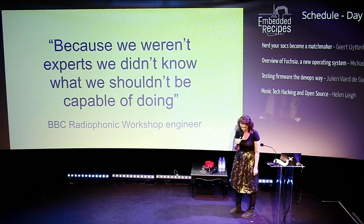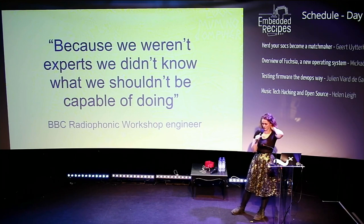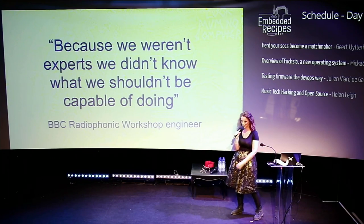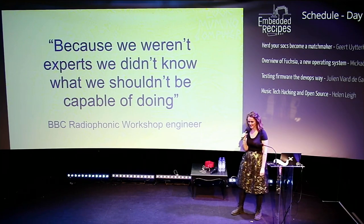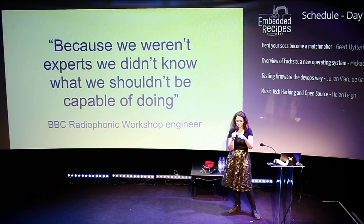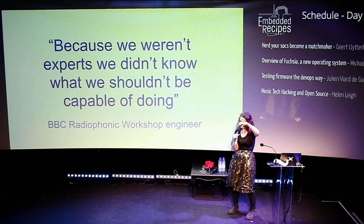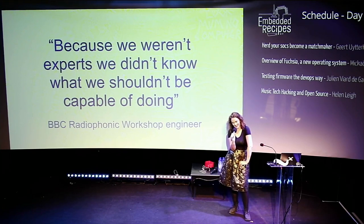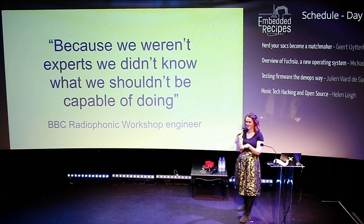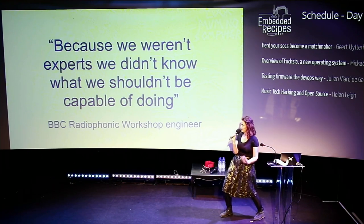One of my favorite music tech creators, Andrew Hockey, who I work with a lot, was like, Helen, I can't get my circuit working. So we went to the pub and I turned it over and I was like, what are these things? And he was like, well, I don't know. He was soldering it with plumbing solder, so the soldering joints were this fat. And of course, in the middle of plumbing solder is acid. So I was like, mate, please never do this again. You are literally just destroying your circuits as soon as you make them. So we had to resolder every single joint. So basically, none of us know what we're doing, but we're all having a really good time.